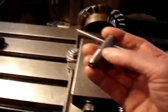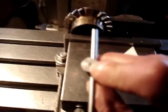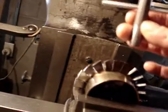A couple of things you need. You really need to make a claw tool and it needs to be made out of fairly strong metal like chromoly or stainless. I center drilled it so that a dead center in the chuck fits into the claw tool like that.